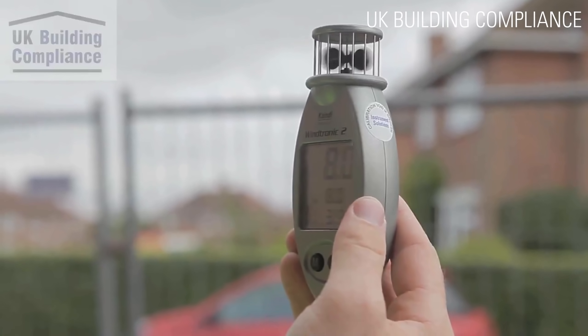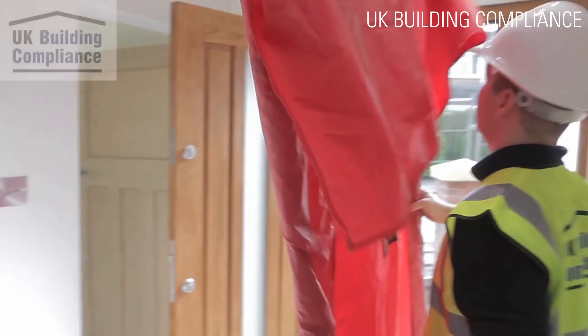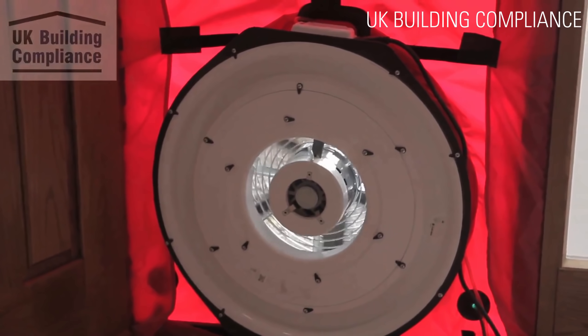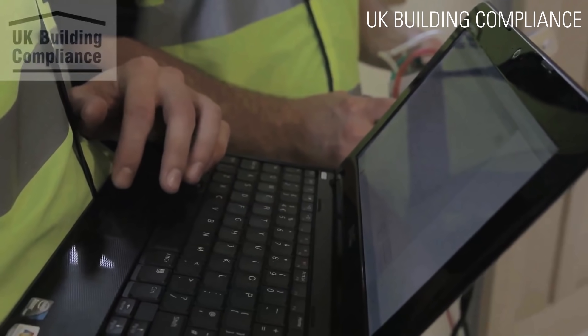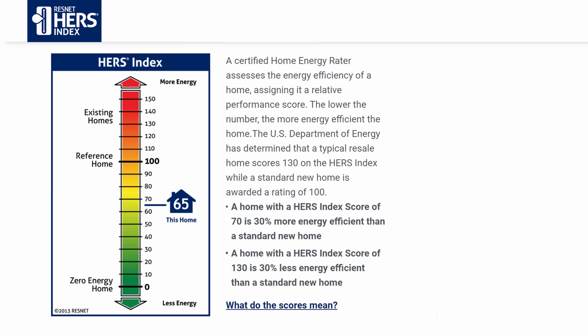Another advantage is their air tightness, provided you use good quality doors, windows, and a roof. The continuous interior and exterior insulation also prevents mixing of cold and warm air, thus reducing condensation and mould. Air changes per hour, or ACH, is a measure of how many times air within a space is replaced in one hour. ICF homes with a wooden roof have 1 to 1.5 ACH compared to wooden homes which have 5 to 12 ACH. So an ICF home has less air leaking through the walls, so you can downsize your air conditioning system and see a reduction in your energy bills. The Home Energy Rating System, or HERS index, measures efficiency of a home — typical homes score about 130, but ICF homes typically score in the 30–50 range.